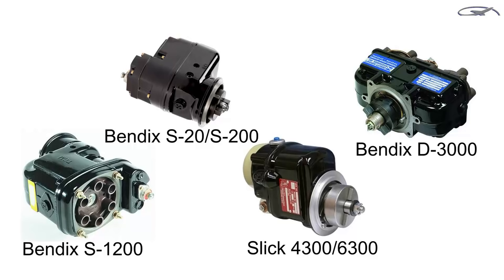There are basically four families of magnetos used primarily in our piston aircraft engines — at least the horizontally opposed ones: Continentals, Lycomings, Franklins, and so on. The S-1200 is a big giant magneto — it throws a very hot spark, it's really the best of the group. The problem is it's physically quite large and there are quite a few engines where there's just not enough room to put a Bendix S-1200. But if your engine can accommodate it, that's the best mag to install because it's the most reliable and throws the hottest spark.